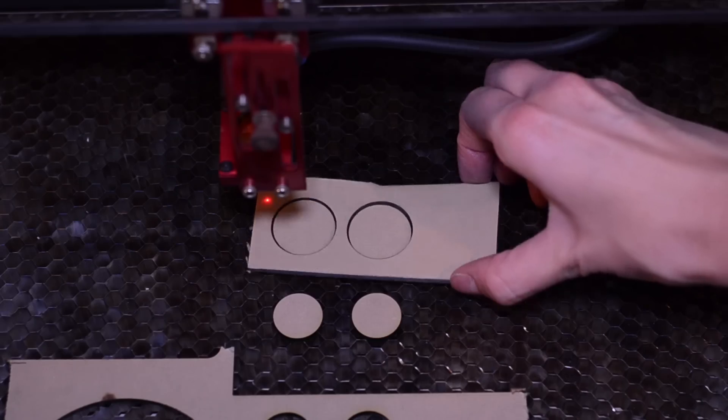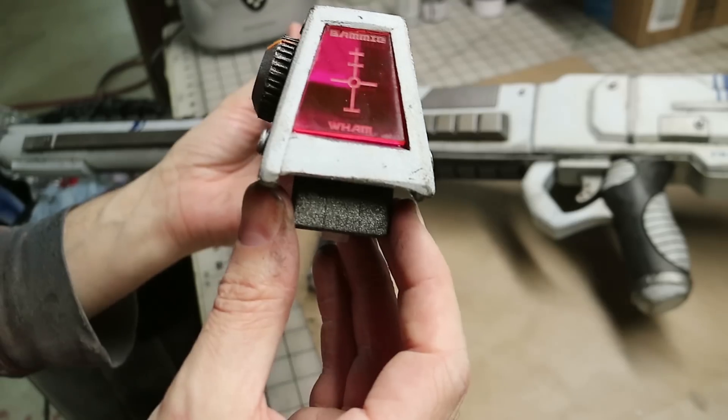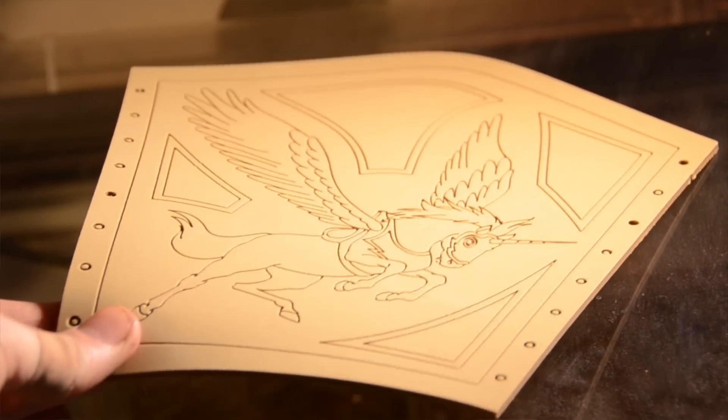You could totally cut these out by hand, but if you have a laser it's awfully handy. I also use it for cutting out circles because it can draw a perfect circle. Lasers are also awesome for etching designs into acrylic plastic to make heads-up displays for your costume or for cutting out lenses for goggles. And if you want to make something look super legit you can etch text into the surface — not only does it make perfect looking text, it's etched in and looks like it was made on a machine. You can cut a whole bunch of different materials — I mostly use wood, acrylic plastic, styrene plastic, and EVA foam. No PVC, don't cut PVC, don't cut Sintra. Also remember that this cut goes straight down — you can't cut bevels, at least not with simple operations. It's also not considered dimensionally accurate the way a CNC mill might be, so you can get things really close to dimension but not perfect. But since I tend to work in bandsaw tolerances, the laser is just right for me.